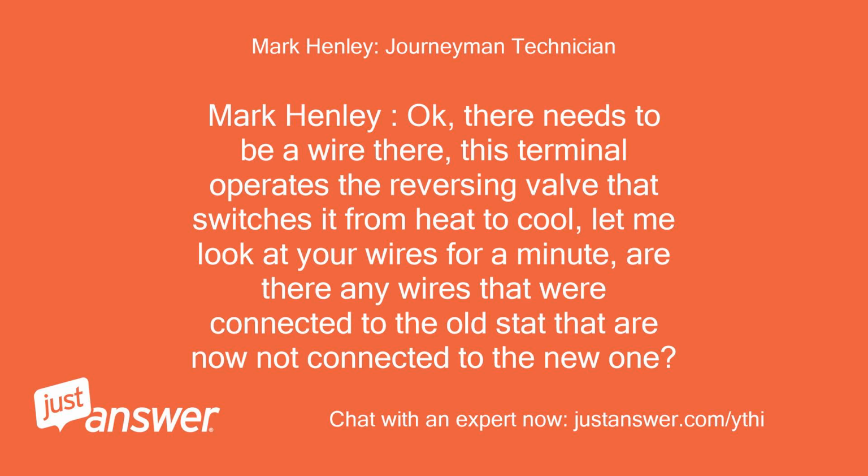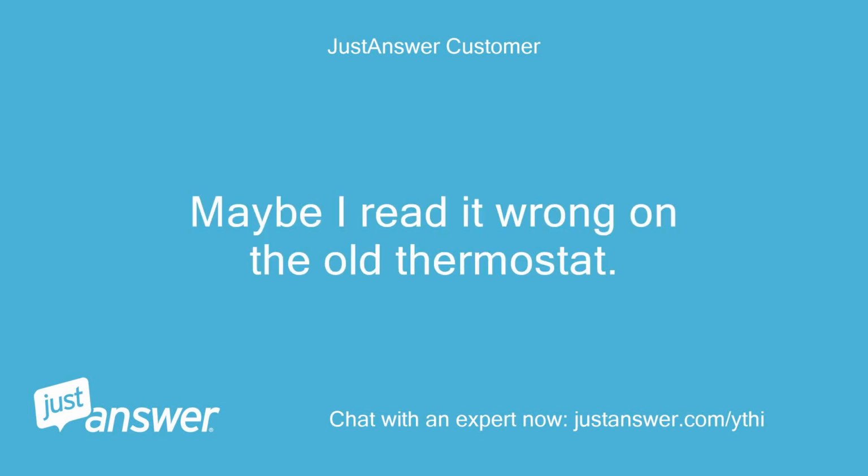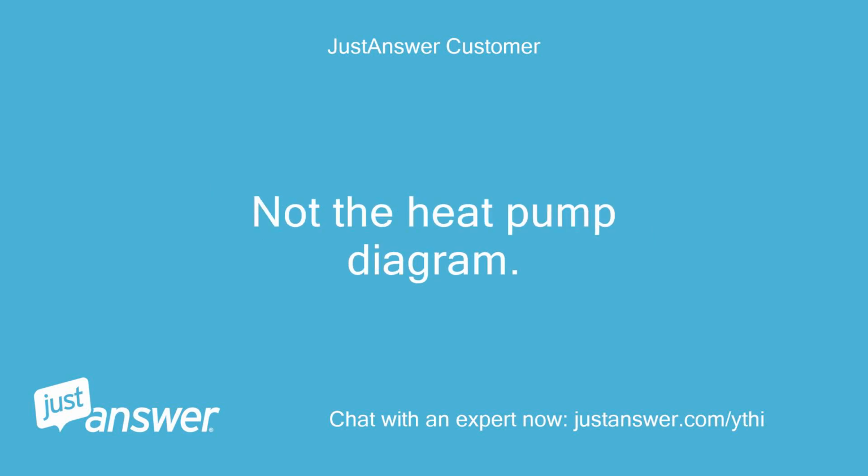Mark Henley: Okay, there needs to be a wire there. This terminal operates the reversing valve that switches it from heat to cool. Let me look at your wires for a minute. Are there any wires that were connected to the old stat that are now not connected to the new one? Maybe I read it wrong on the old thermostat. I was reading the letters from the conventional diagram, not the heat pump diagram.